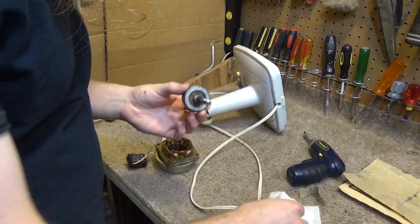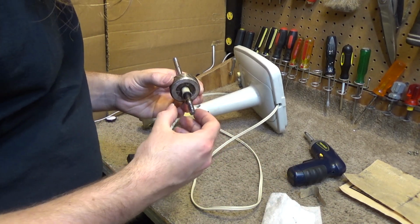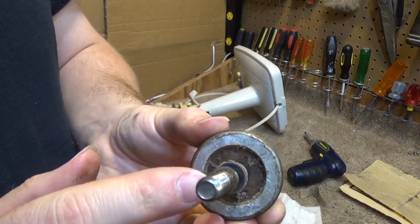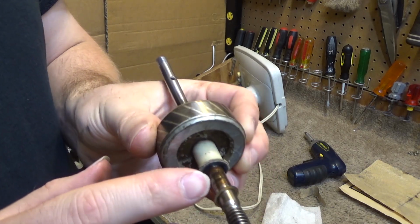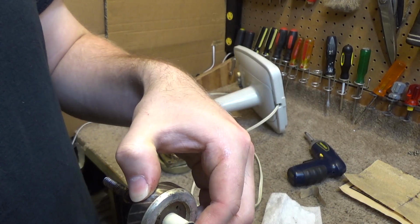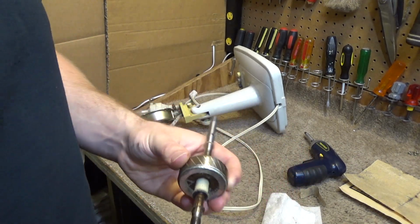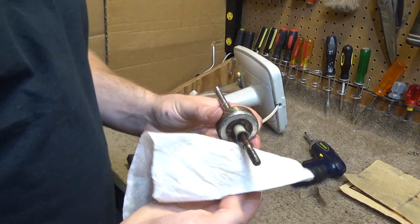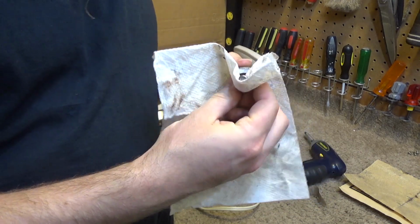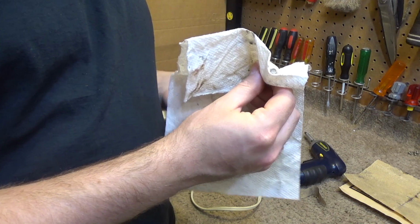So that means this one would have come off the back. And you can see the difference in the front and the back here. Look at the back. That's all turned black. That's got wear marks on it. This is still white, and this has got some wear on it, but nothing major. So this definitely suffered severe lack of lubrication at many points in its life in the rear bearings. And that's probably what ultimately caused it to be discarded.